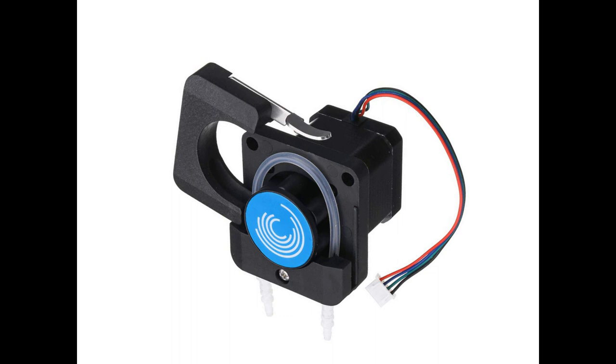I use 3x5mm tubing. In general you want to use the widest tube that the pump will accommodate, as it allows for a lower motor speed and a longer tube life.